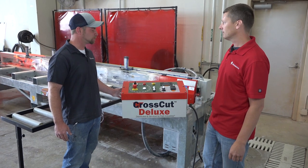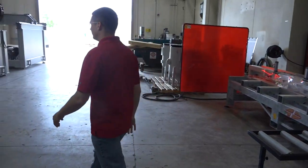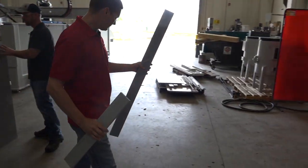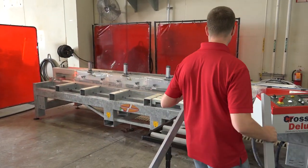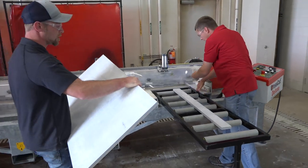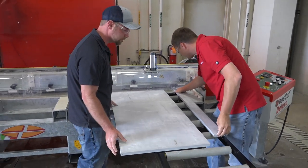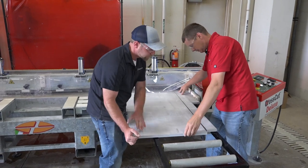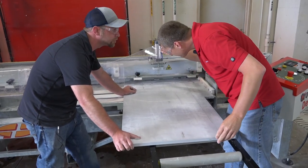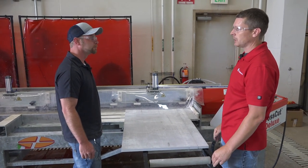Let's throw some parts up here and make some miters. Today we're going to cut some 2CM quartz — one countertop and two aprons that we'll put together. We'll do polished side down. Another nice thing is I can cut multiple parts at once — there's a stop here that you butt them up against. The machine is capable of going from 43 up to 47 degrees, so we cut just past 45 for an outside miter. For inside corners, you would do polished side up.